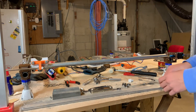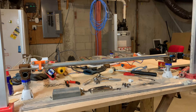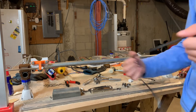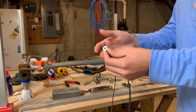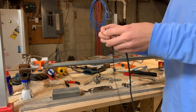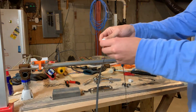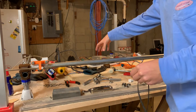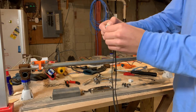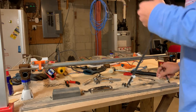The main goal of converting the MPCNC to use lead screws is to increase accuracy and increase rigidity. One of the things I noticed when the MPCNC was on belts is these belts have some flex in them, so that when these steppers are locked, it can still flex the belt. Another place you can see this flex is if the cutter is going through load milling something like a metal — instead of moving the whole gantry, it just tensions the belt.